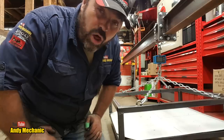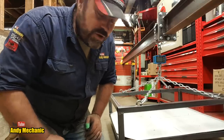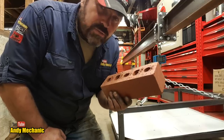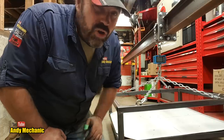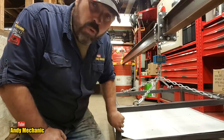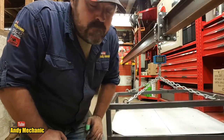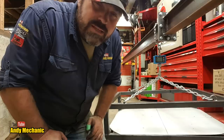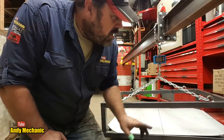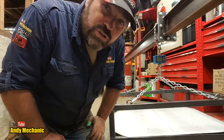It's been a really long day today, but we've got this made — yes, it's a new coffee table, but for now we're going to use it to put some bricks in. Each of these bricks weighs almost bang on 2 kilograms. We're going to need not quite 125 bricks, because this frame already weighs 32.5 kilograms — weighed on the engine hoist — so we can deduct that from the 250, which leaves 217.5 kilograms. We've got probably just over 100 bricks to put in to apply 250 kilograms onto the crane scale and the beam.